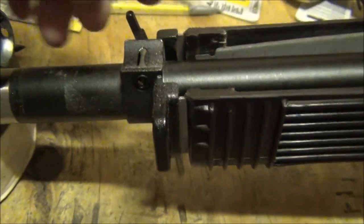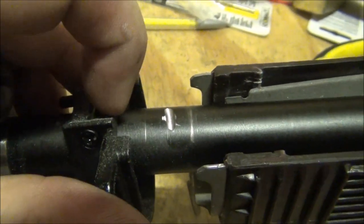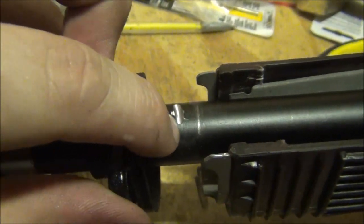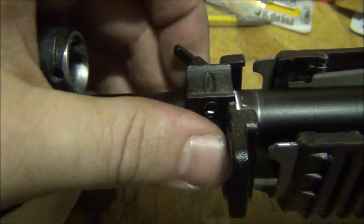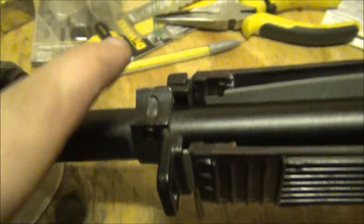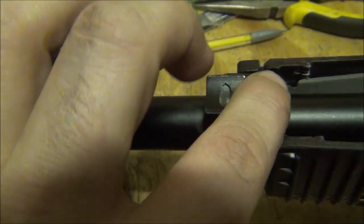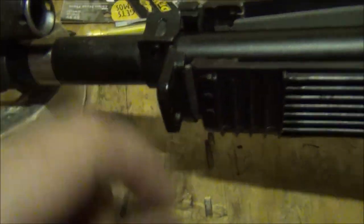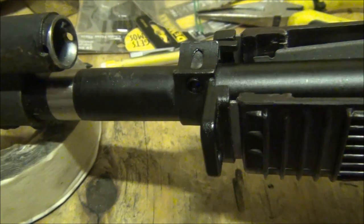We've already got it to rotate about halfway, which is really close, and I haven't cut it very much. The problem is: do I need to go deeper, or do I need to go wider? I'm going to go just a shade deeper, maybe on these sides here, and we should be good to go because it's already rotating. We've already gone from that much on the barrel to that much in the slot, so we've already got halfway up. I really didn't make it any deeper — I just kind of wallered it over the ridge a little bit, and this is tight. I had to tap it down with a hammer to get that to close, but I can still tap it back up if I need to, and that is exactly what I want. I'm going to go ahead and check this guy by hand and then hammer the pins in. We're looking pretty good.